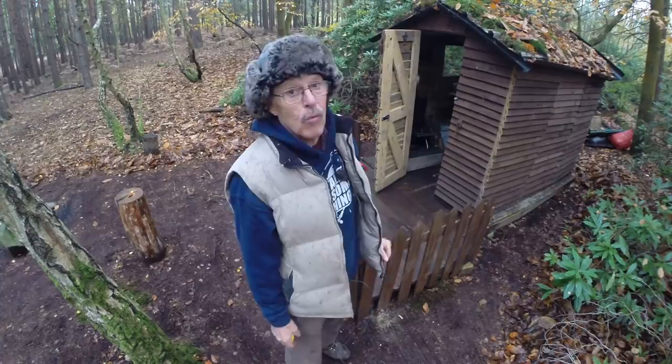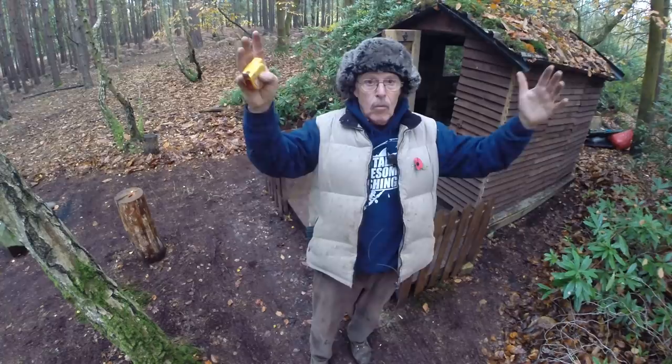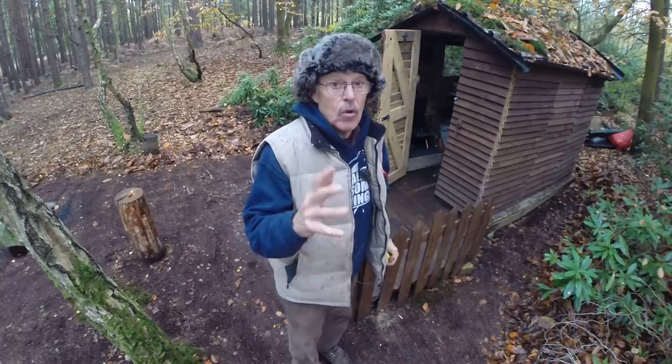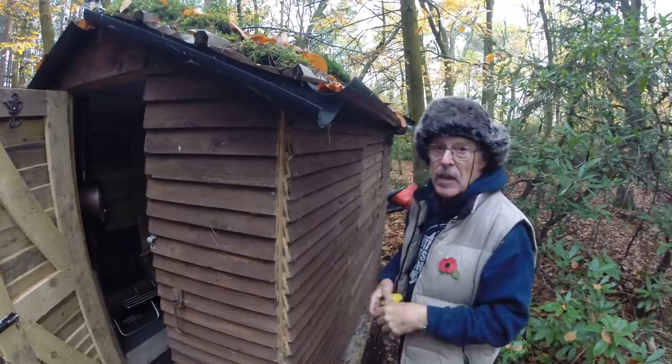Outside, all I can say is what you do is, if you've got the pallet, don't strip all the nails out the inside along those edges. Just cut just inside them with a saw, and you only have to generally take the nails out of the middle, and that gives me sections of this. I'm going to give you measurements so you've got an idea. So look, this is all with one line of nails just down here, this particular edge of this pallet.